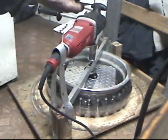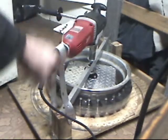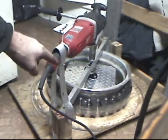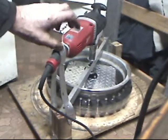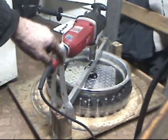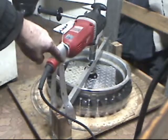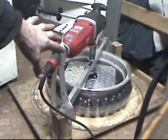I've only got two 1-inch rollers on this, one at each end on the rotor. The outside has got the 3/4-inch right-hand twisted neos on there, and in between I got 14 high of the 1/8-inch thick ferrites. And the only difference between this and the other ones, besides running it on the inside, is I've got the spacing between the stator magnets spaced about 1 3/4 inches apart, which works very good, or should, with the 1-inch mags.